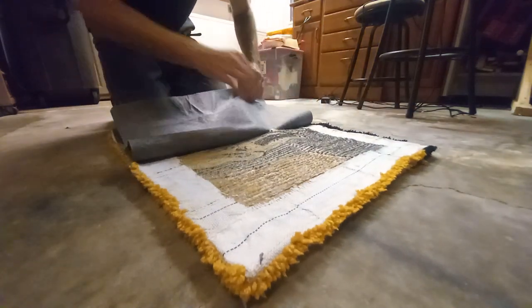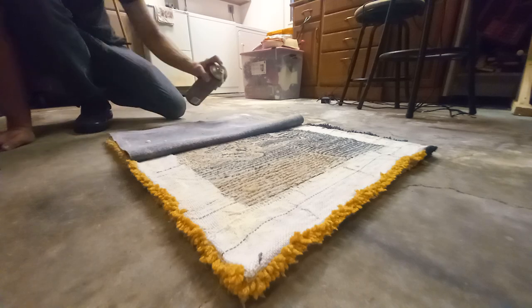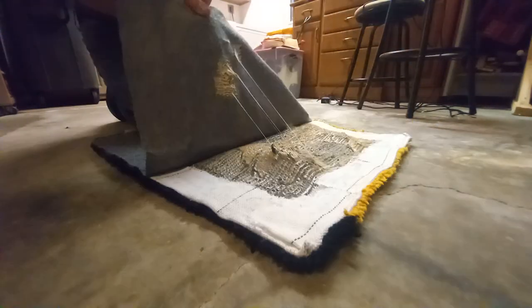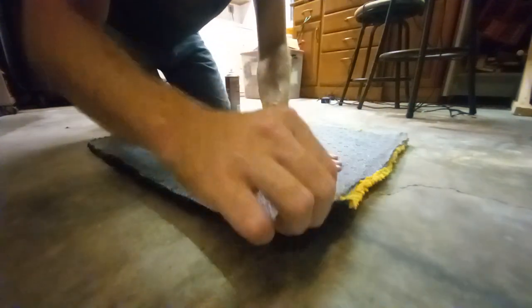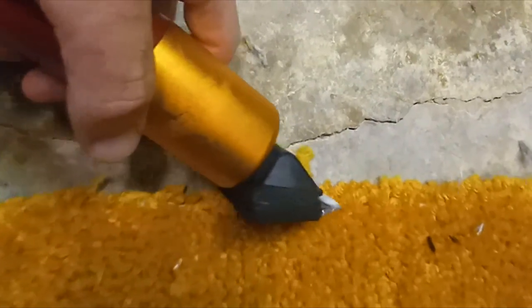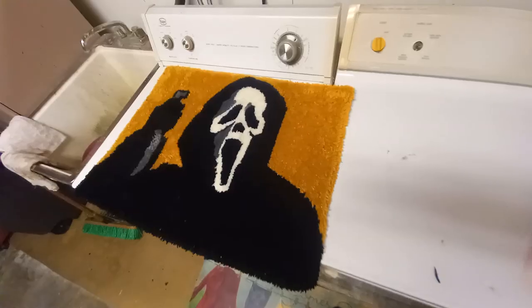It's stuck to the carpet adhesive a little, so I'm peeling it away, then using spray adhesive — being very careful not to get it on the edges — and giving it a nice thick coating on both the back of the rug and the back of the anti-slip fabric. I do one side at a time, patting it down. Funny thing is, when it comes out of the can it's super cold, so patting it down just feels very cold on my hands. Same thing on the other side — nice thick coating, patting it down, making sure everything bonds nicely and nothing peels up later. Now it's time for the final trimming along the edges.